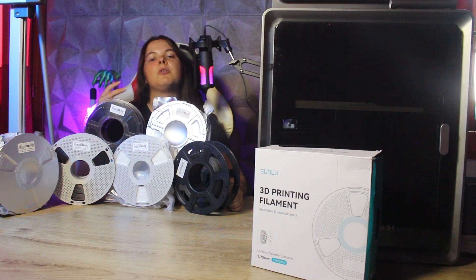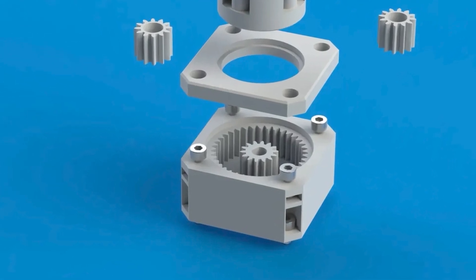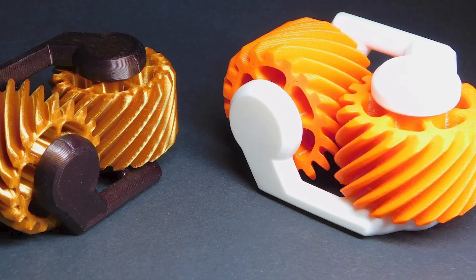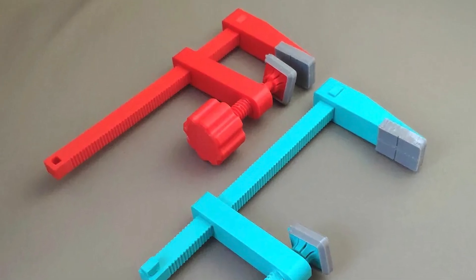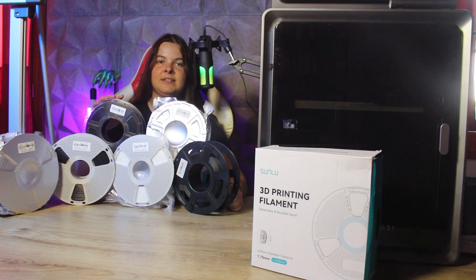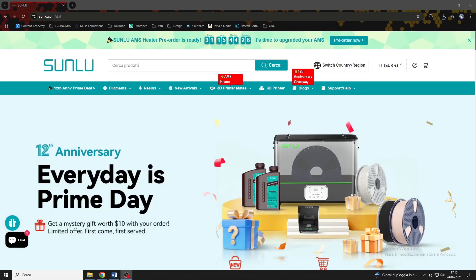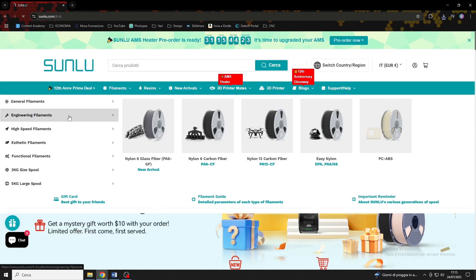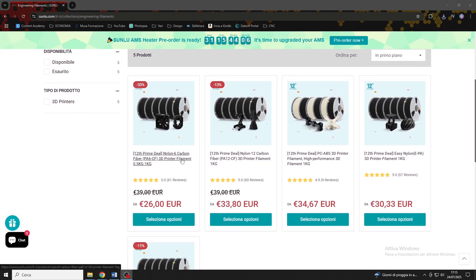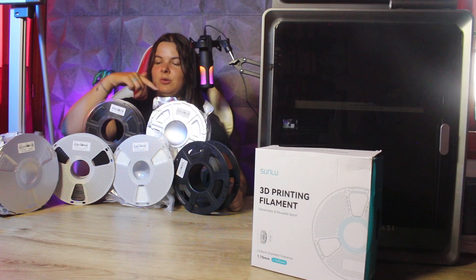Therefore, Easy PA is suitable for many uses. For example, mechanical parts that need to be both strong and a little bit flexible, such as gears or mechanical components subject to cyclic stresses, or even light industrial applications. It's also ideal for functional prototypes that need to resist impacts and abrasion. As you can see on the table, I have all filaments from Sunlu, which has recently added a new line of different types of technical materials to their catalog. I highly recommend checking out their website if you're curious about trying new filaments — links are below in the description.